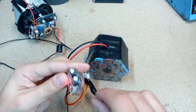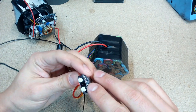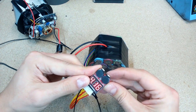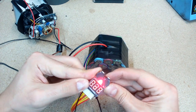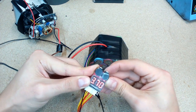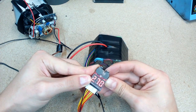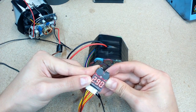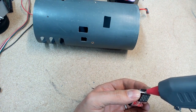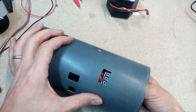The alarm was set by clicking the small push button at the top of the voltage meter. I set the alarm at 3V — when one of the 6 cell groups connected in series reaches this or a lower voltage, the buzzer will start beeping. That's the sign to charge the battery pack. Fixed the meter in place with hot glue, then later applied epoxy glue for a stronger joint.